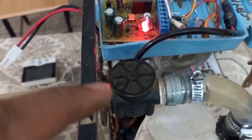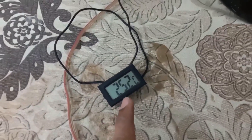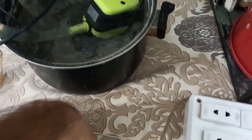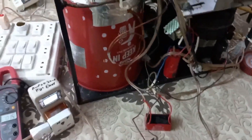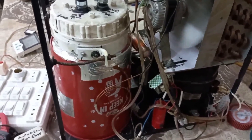Here is the circuit for this. After water flow, this will give the signal. At this time the water temperature is 25.2 degrees. Only 3 or 4 liters of water, but it will be okay for analyzing the system. Ambient temperature in the room is 30 degrees. To reduce the current I have connected running capacitors — these are two running capacitors. To connect running capacitors there is a specific circuit; without this circuit if I connect the running capacitor, the compressor can get damaged. I have explained this in another video and will put the link in the description. This is the starting capacitor, 80 to 110 microfarad — it has no link with the running capacitor.